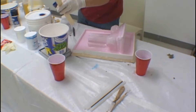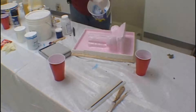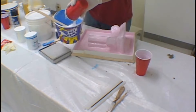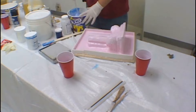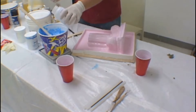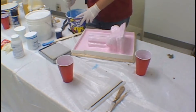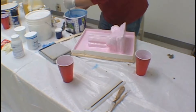This time we're going to use a different color for the third coat so that we can differentiate between the second and third coats. This will make your life much easier when applying your silicone rubber. As in the second coat, we add our powdered thixotropic agent to our silicone base rubber after it's been pigmented. Thorough mixing is very critical here, as you are adding a lot of thickening agent to produce a very thixotropic coat. When adding the catalyst, make sure it is weighed out properly, and thoroughly mix all of the ingredients. Scraping the sides and bottom is a very good technique for ensuring thorough blending of rubber with the catalyst once it has been thickened.